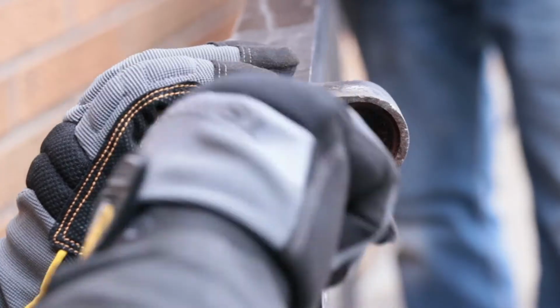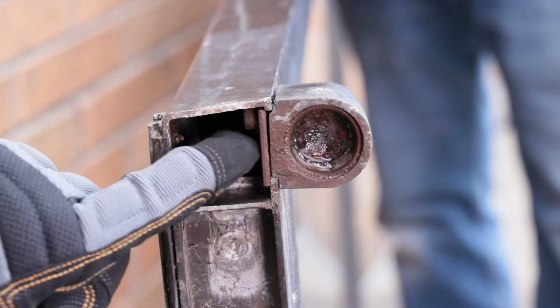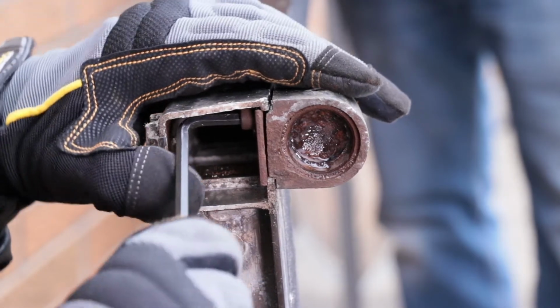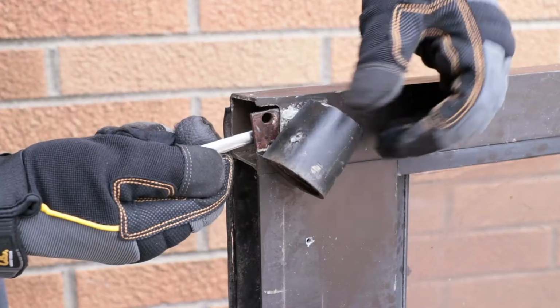Next, remove the door portion of the pivots. Start with the bottom pivot. Remove the hex bolts and Allen screw from the existing pivot and backplate using a 7/16 wrench and the 3/16 Allen wrench. Remove the pivot and install the new door pivot, reversing the operation with the same size wrenches.